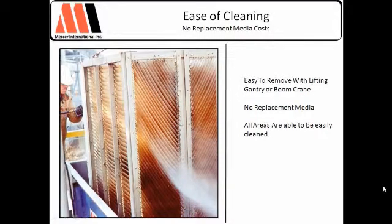Now, if you can't clean your coalescer completely, the inside doesn't get cleaned out — as you saw in some earlier photos. So the moment you put it back in for work, you already have reduced performance: an immediate reduction in the ability to pull out oils. Not only that, but you're handicapping yourself on how long you can extend your cleaning intervals.